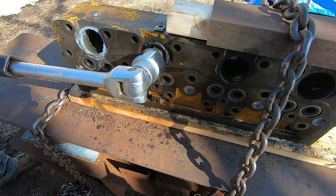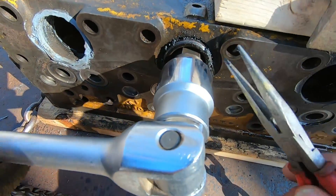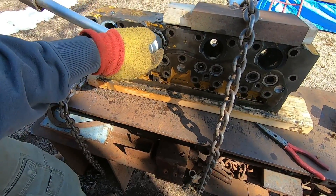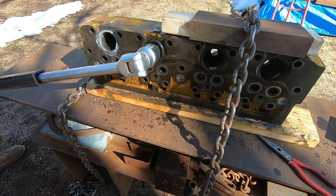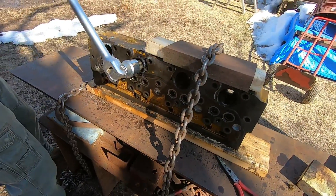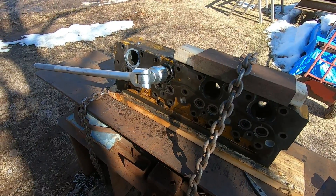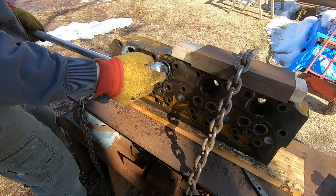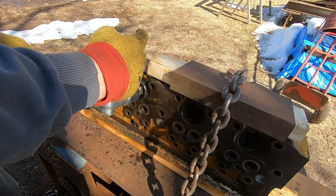Number two is just about out. You can see that's old o-ring peeling loose right there — that's pretty much why it's good practice to replace o-rings on these old units. About the time you get one all fixed up, it starts leaking and you have to start all over again. She's really starting to turn good now. It's a victory when you only need four foot-pounds of torque. Can get rid of the cheater bar. Still stiff in there from the rust — getting some more penetrant in through that set screw hole gets it below the o-ring.